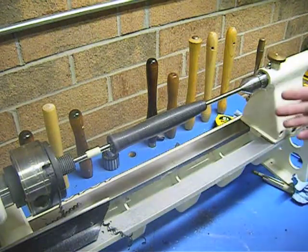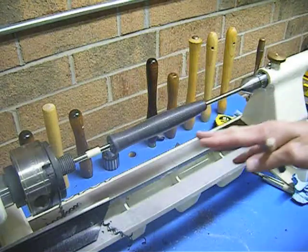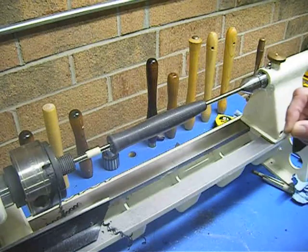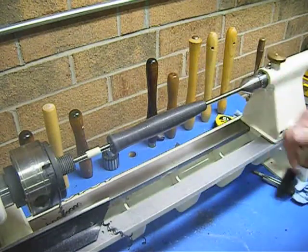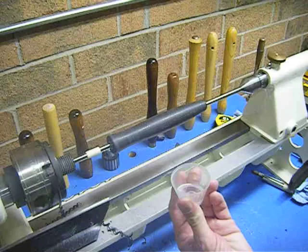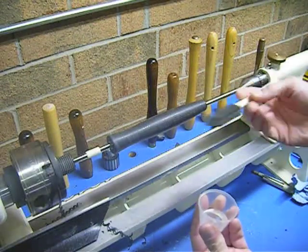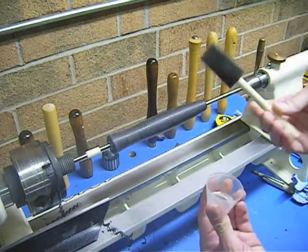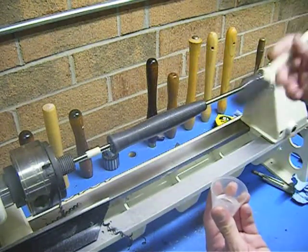This is going to go very quickly. The product has been sanded through 400 grit. Do not wipe or wash the top with a solvent — never use a solvent as the last step in your surface preparation. If you want to take a soft bristle brush and knock the dust off, that's fine, but do not wipe the top with solvent. I have a plastic cup here with some Permagloss in it and a gray foam brush. Be careful — some brushes will not withstand the solvents in the Permagloss or Lumaseal. The gray type tend to be okay; the black ones will melt. Test first.